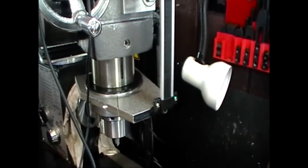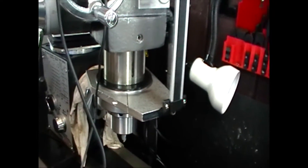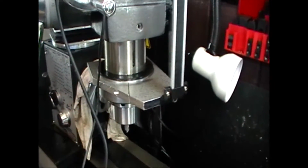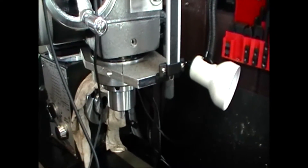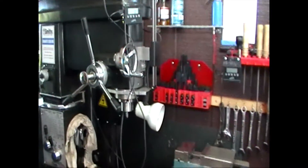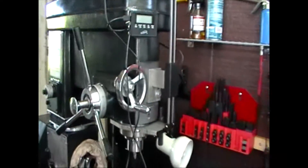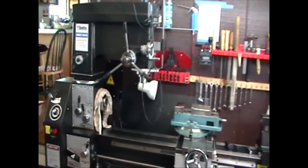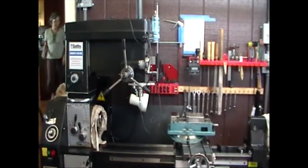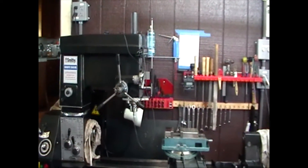You'll notice there's a slit — I used a hacksaw since I don't have a slitting saw. I bored the hole on the lathe itself. I do have the dimensions and I'll give them; however, I've found that these Granite 1340s and 1324s, even though they're very similar devices, are not all exactly the same — and I'm sure that goes for most lathes. So if you're going to try to make this, you'll definitely want to do your own measurements.